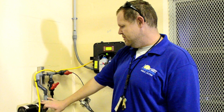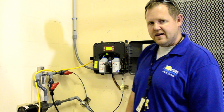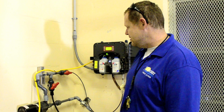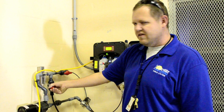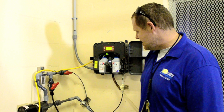So we put in a little booster pump that sucks the water right out of the suction line for the high service pumps and boosts it up to an adequate pressure. Got a little bypass valve here to control the pressure. And after that, it goes right to the instrument.